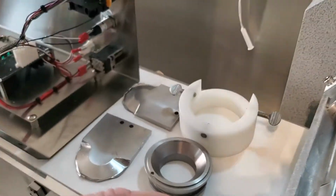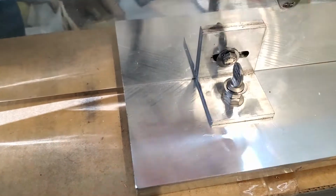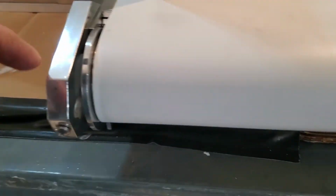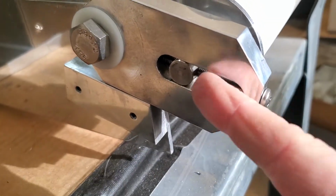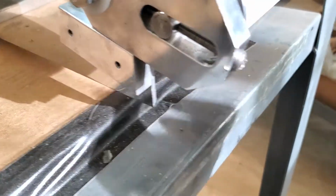The conveyor, as you just saw, is splined in that way, and it's held in place by two L brackets, one there and one here, and there's just a little spade type thumb screw you take out and you remove the whole conveyor from the machine, which we'll show later. And then at this end is the tension adjustment. Pretty straightforward. There's a screw going in there to the shaft that goes across this pulley, and you screw it in or out to move it in and out.